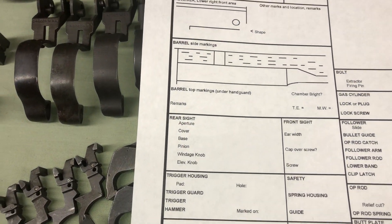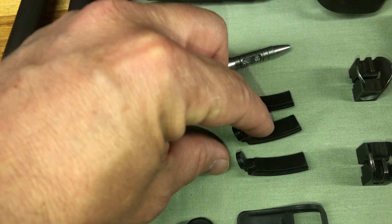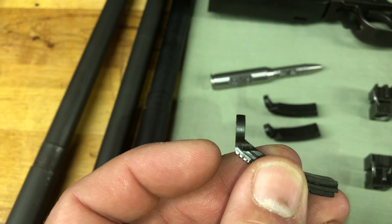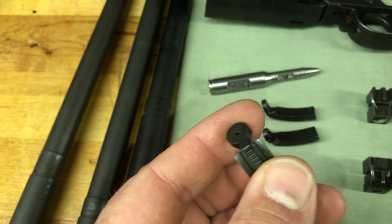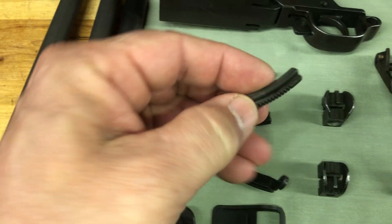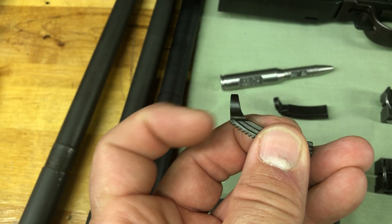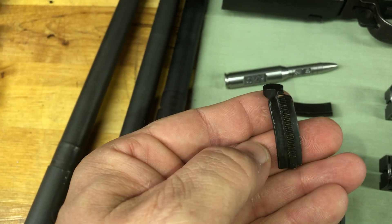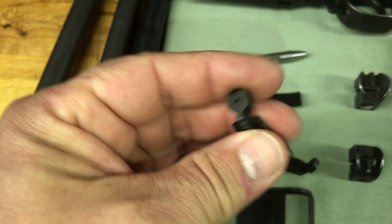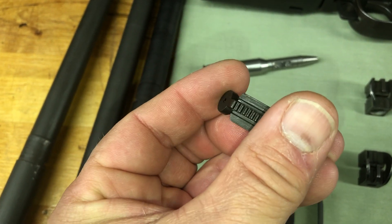Talk about the color of the outside of the barrel - is it refinished or not? Rear sights, apertures. These are the apertures we're talking about. This one here is a Springfield - this little area right here with an almost angled cut is indicative of everybody but Winchester. This one has tracks left and right of the splines cut in. See how this aperture is shaped on a nice slope - that's indicative of Winchester. This one doesn't have any tracks on it; it's solid right there. Winchester's usually had a punch mark right there, and this could be a later one with a little bit of a curve to it, but with tracks.